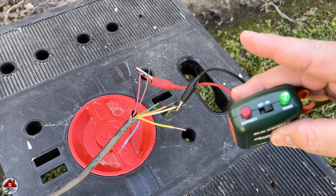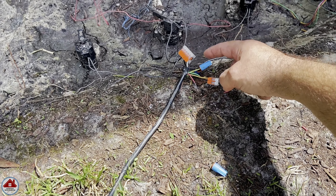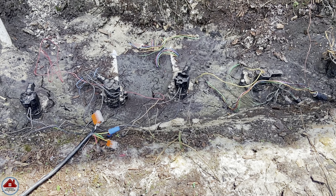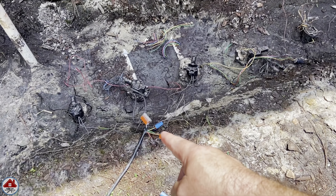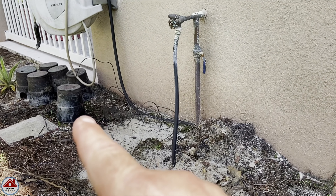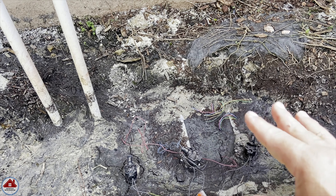Later in the video I'll show you how I tested and troubleshot the wire. Originally red was zone one — that went down. So I went with green, but then that went down too. Then I went with yellow, orange, and blue, with all the second solenoid wires on white for common, and I got three zones for the front yard working at least. This is why I needed to complete this project before my lawn suffered during the non-rainy part of the year. I think the wire colors stopped working because they were submerged in water. I also realized that a sprinkler head right nearby — covered by one of the old valve boxes — and another one just to the right of all the valves, was what was filling up the area with water. I thought the whole time it was a leak.